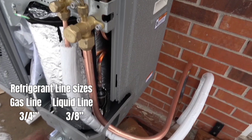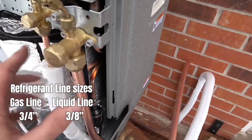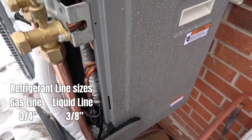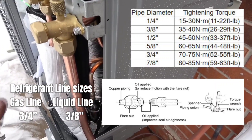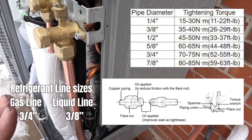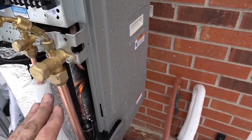We're going to install our return drop here into the furnace and also pipe in our A-coil going right outside the cavity there. Inside the heat pump we have a couple of flared connections — three-eighths and three-quarter. The nuts are provided so you just take the nuts off and flare your piping. I would suggest using a flaring tool with a pipe stop that does a 45-degree angle flare — it works really well. I like to use Nylog on my flare seat; some people like to use POE oil instead, some like to use nothing, but make sure your flare is good. It's also recommended to look in the manual for the torque specs and use a torque wrench to torque your nuts.